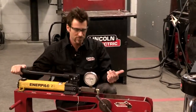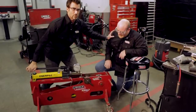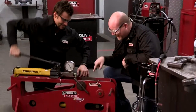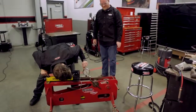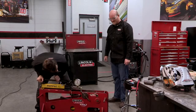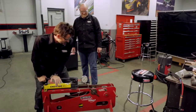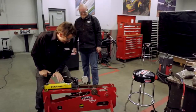Find some way to see how your welds are doing. We're doing a simple test here. We're at 1500 pounds — and that's a lot. Prosser welded this one. When you're doing this kind of testing, you don't want to stand right over top of it — get away from it a little bit because you don't know what's going to happen when it goes. We're trying to break it. We're at 4500 PSI. Still going. We're almost at six thousand, going up to about seven. Still at 7000 — that's stretching. Oh yeah, you can see it totally pulling. Let's pop it.